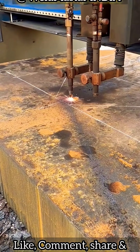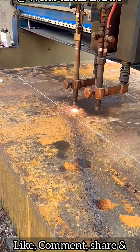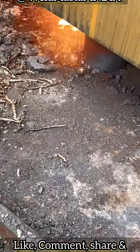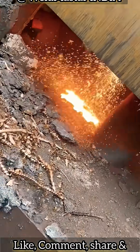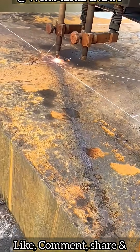Some people say it's so thick, I'll go slowly to cut in. But if you slow down, it won't penetrate. Once the speed drops, the channel won't form, and that creates a short risk. After cutting just 2-3cm, the flame may blow out with water. So always remember: full speed forward.